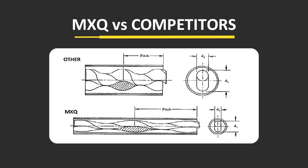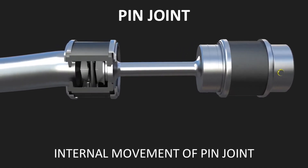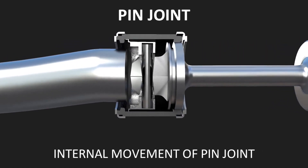The MXQ design has an elongated rotor-stator profile. This reduces the rubbing velocity, lowers the required starting torque, and increases the life of the joints and bearings. The result is an increase in pump service life by as much as 40 percent. Another added benefit is a lower shearing force on the liquid pumped.